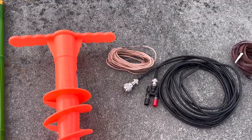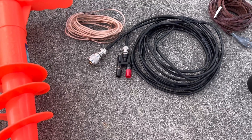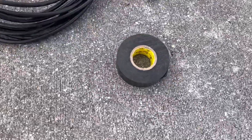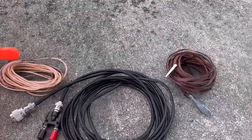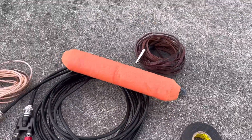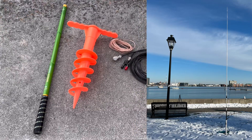I have a sixteen foot five inch piece of sixteen gauge speaker wire. I buy that by the roll at Walmart for sixteen ninety-nine a roll. A banana clip — got that on Amazon, I think you get a pack of three for about nine dollars. I have a short, about fifteen foot coax. I'm going to be using my G90, so I got the connectors sorted for that. A roll of old electrical tape — I'll use that to tape the wire to the pole. And here in the water I'm going to use my one bare copper counterpoise, about twenty feet long, with a little float to keep part of it above the water.